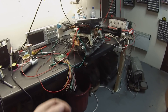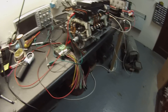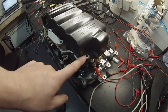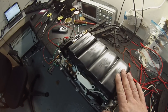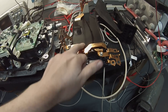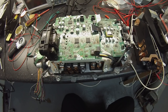Here I have the Gen 3 inverter converter with the top and bottom covers removed. In order to power it up, I've taken the capacitor out of the lid — this cap is normally bolted into the lid. I've just pulled off the capacitor, and this isn't one but actually three high quality Panasonic film capacitors inside.